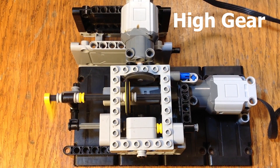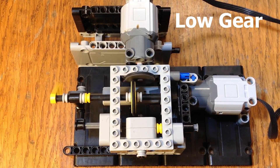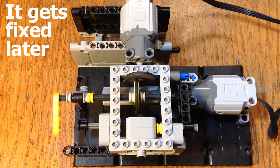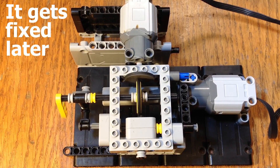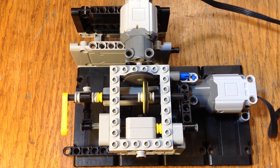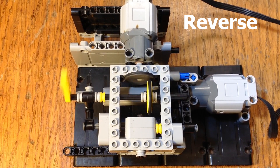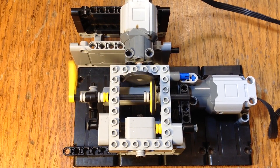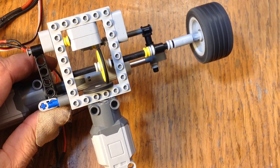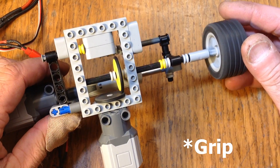As you're watching this, notice the drive has a bit of a wobble in it. It's happening because the friction disk isn't quite flat, and the O-ring that I have here is a little too tight, so it's kind of stretched out and I can't get it perfectly round. That wobble's kind of limiting the amount of torque that I can get, because where the O-ring's fattest the pressure's increased, and where it's thinner there's less friction.